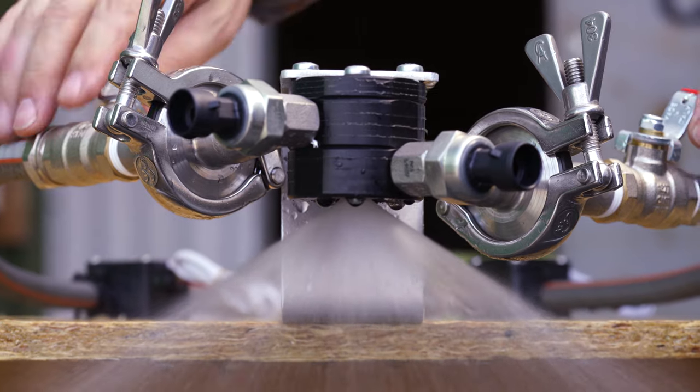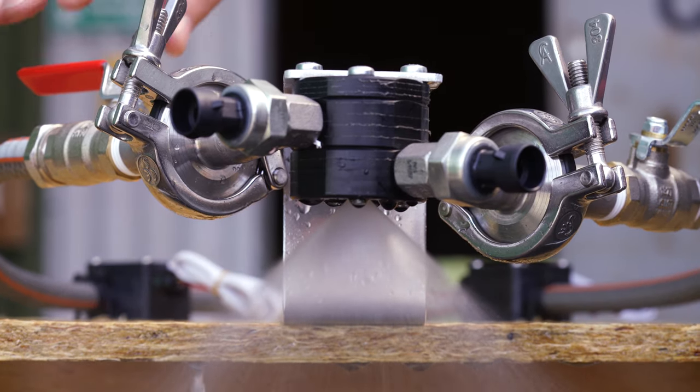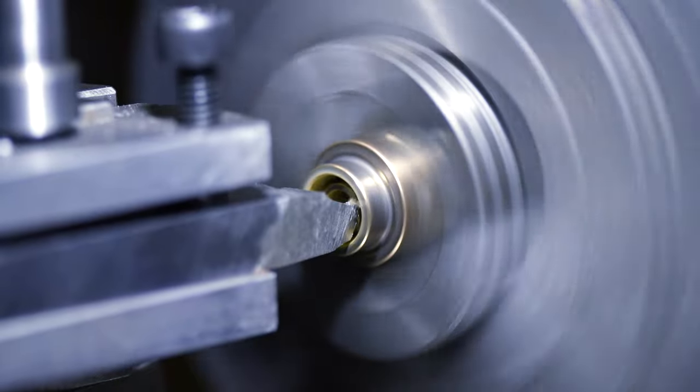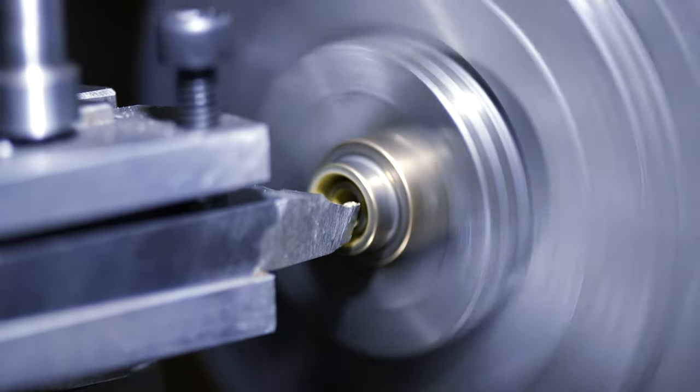We'll be testing the flow as a function of pressure and also visualizing the spray pattern. We'll probably get started on that next weekend, and then I think we might play around a little with the geometry. The swirlers we have right now — we can change the geometry to a certain extent, put them in the lathe, remove a little bit of material, make one lip shorter than the other, and play with geometry that way to see if we can steepen up the cone a little bit. But for now it looks really promising — we're super happy to finally put some flow through some swirlers and we'll definitely play with it more next week.